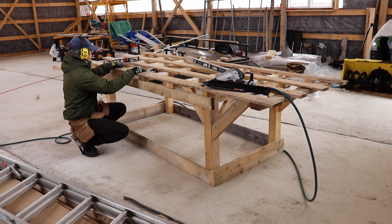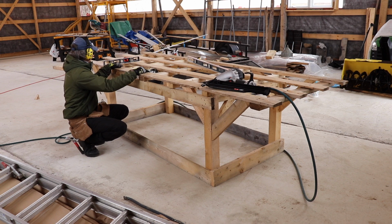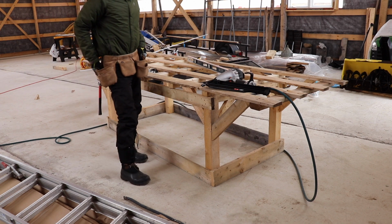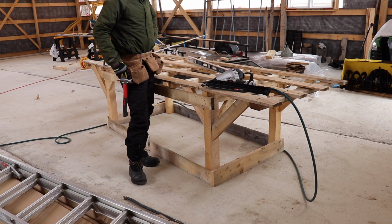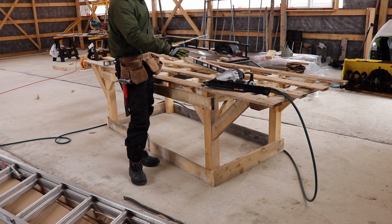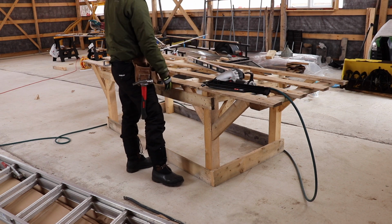And decide what I'm going to do to round off the actual counter surface, the workbench surface. And again, I'm thinking of just some MDF or something affordable like that and just countersink some screws in here. That way I'll be able to get a vise mounted on here, put the vise in here and maybe add some additional blocking for a vise.